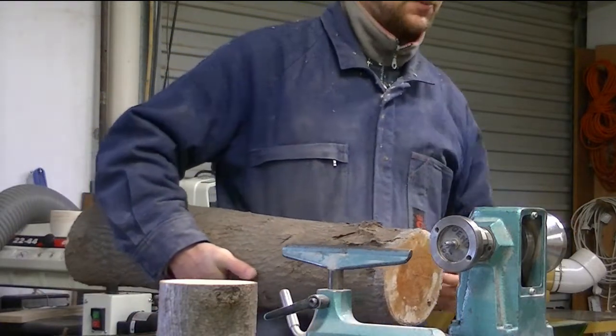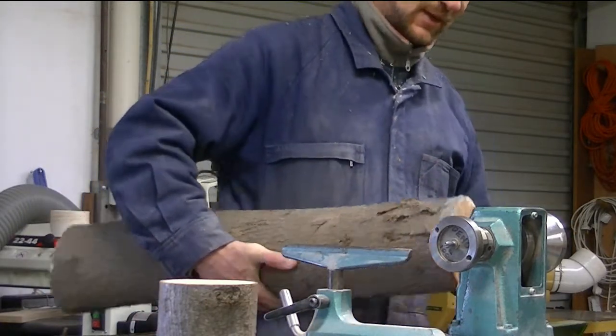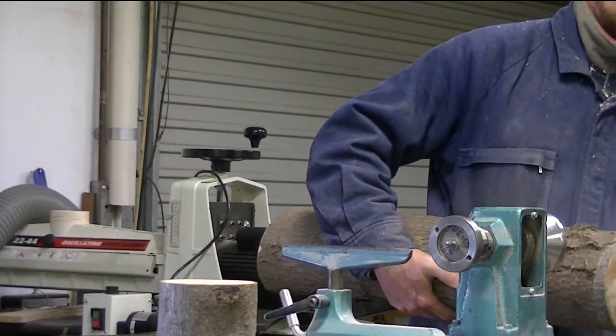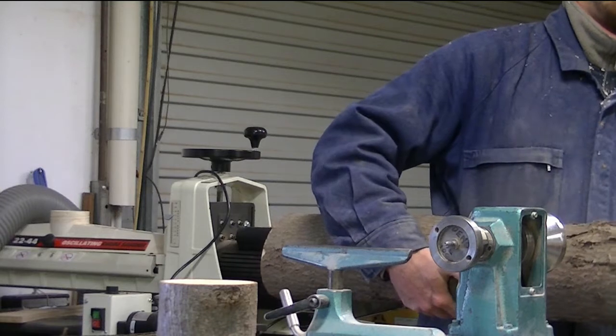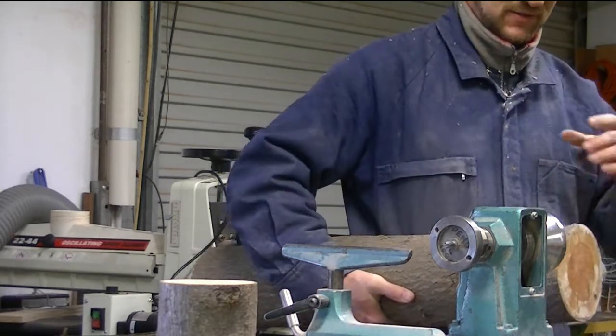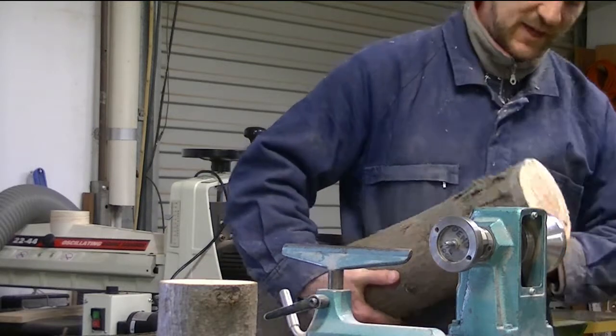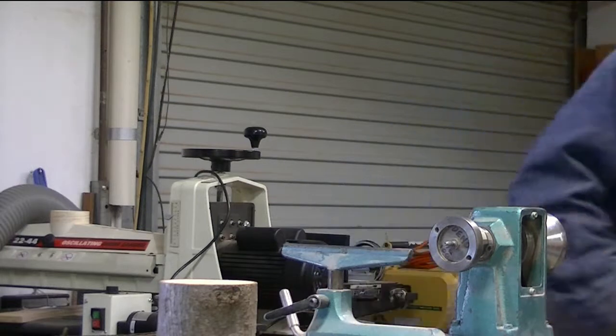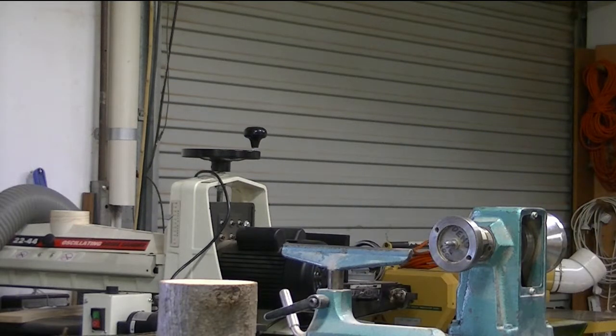I don't want to sound like a professional by any stretch, but what I usually do when I get a piece of wood is dip it in wax, basically, and put a hard surface on that, and that stopped most of the splitting. You can still see with that, there's still a couple of smaller splits right in the end of it, but they're probably not going to go more than an inch or two.